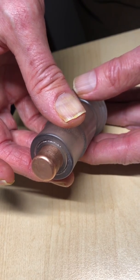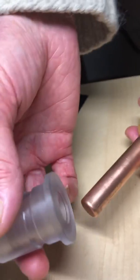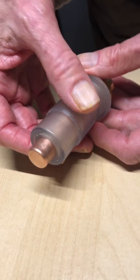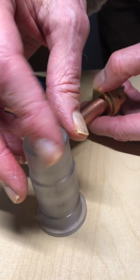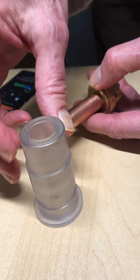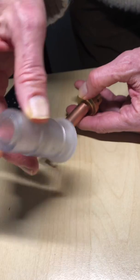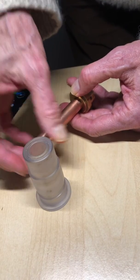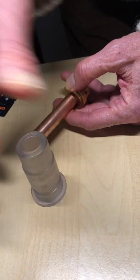What's especially critical is the surface, because it's easier for a spark to travel along a surface than through a gas. This material is called Lexan — a common form of plastic — and this is what we used in the old switches. The used ones got very blackened, and we figured this was a bad thing leading to more breakdowns, so we replaced them with ceramic insulators in the new switches.